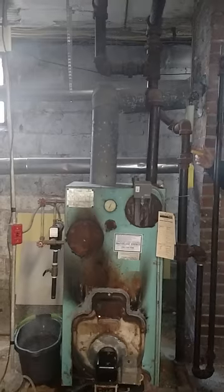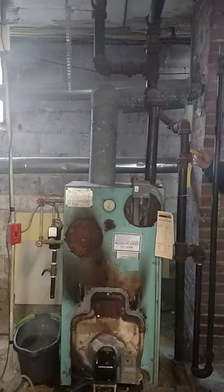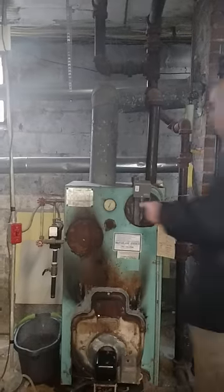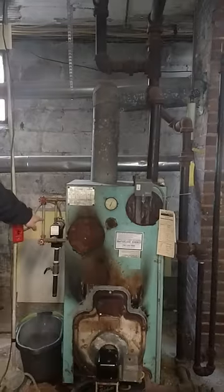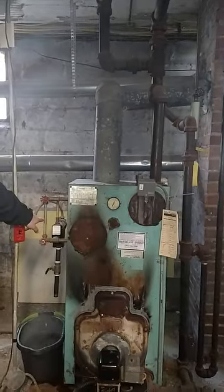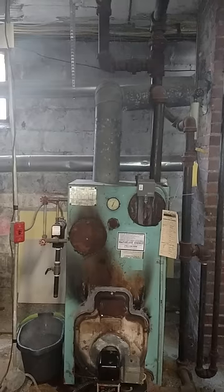And also, don't walk away and leave this running. Your radiators upstairs aren't designed to hold water. Again, when you check your water level, the boiler's is right here. Approximately half to two-thirds is proper level inside your sight tube. And as long as you do that...